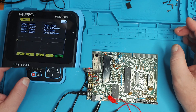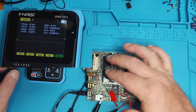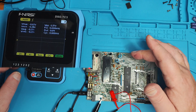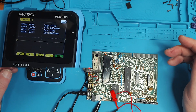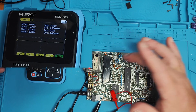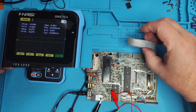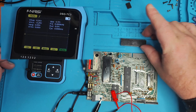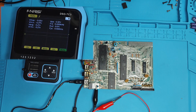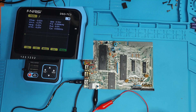Now with it being a good ULA, I've not cross-referenced it — there's plenty of documentation online on what you should be expecting to see. But I've not gone to that trouble because I know that it's working. So from that, let's swap this out and put the bad one in — the one we know is defective. So here I've swapped the ULA, there's now the faulty one in there, got the power into it. Let's give it a go and see what's coming back on the pins.